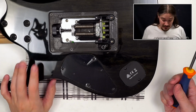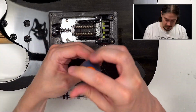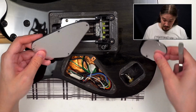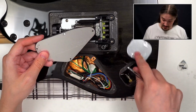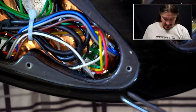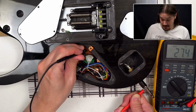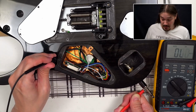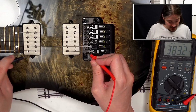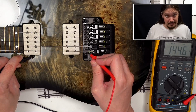Okay, let's open this guitar and find out if it is properly shielded. Oh yeah, it's all shielded, and here we even have some extra foil. Both back plates also have aluminum foil on the back. Here we have a 500K B-type pot for the volume, something slightly more sophisticated than most guitars have. And here's the pickup switch. That's good. That is proper shielding we have here. And even in this part. Pickup cavities are shielded as well. Yep. Very good.